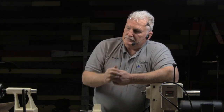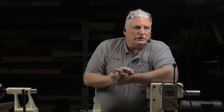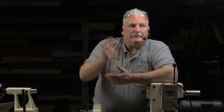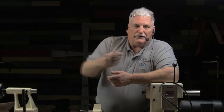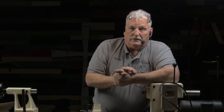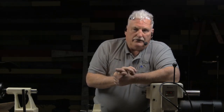They will dull fairly quickly and you just turn it a little bit — got your new edge, turn it a little bit — and when it's all dull you get another one and put it on there. But that tool is sharper than probably just about anything we use in turning, especially those of us who grew up in the day when you used an 80-grit rock — used 36 or 50-grit to shape with and 80-grit to sharpen with. I guarantee you those carbide tools are sharpened finer than 80-grit.